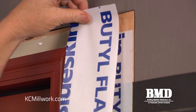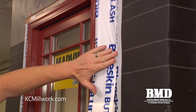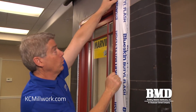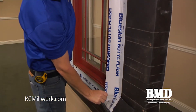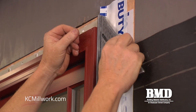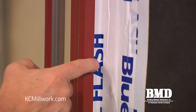We're now prepared to apply the counter flashing over the Marvin nail fin. We're going to use a four inch wide strip of butyl flashing and counter flash over the vinyl fin, because the fin in and of itself is not a waterproof joint. I'll show you a time-saving technique using a speed square to accurately apply the counter flashing so that it rolls up to the edge of the cladding. We're going to pull the flashing that's lightly tacked to the window loose, take our speed square, make sure we're well adhered to the wall, and then roll the speed square sideways to press it into the nail fin window. You'll notice how the counter flashing rolls up onto the edge of the cladding — this is our first line of defense if water gets past the siding.